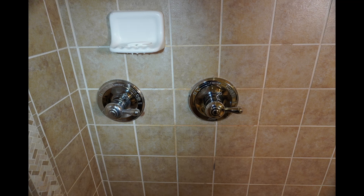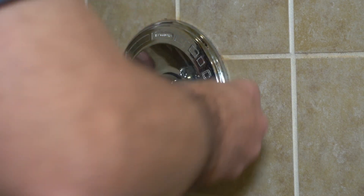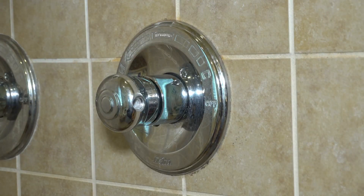On this project we are going to fix a leaking shower valve that you see there on the right. We're going to start by taking the outside of it off, first unscrewing — this is a delta valve — unscrewing the little handle there. Then there's a little hex nut in there that you loosen just slightly, and then the front's going to pull right off.